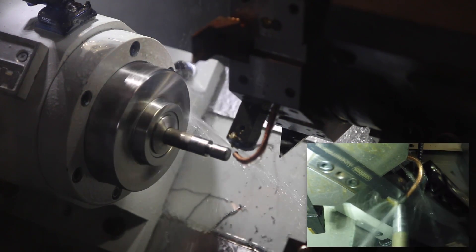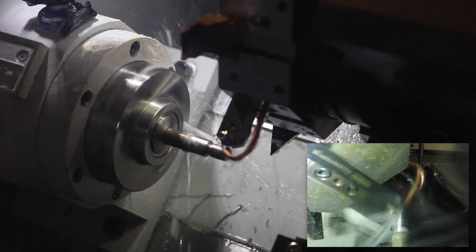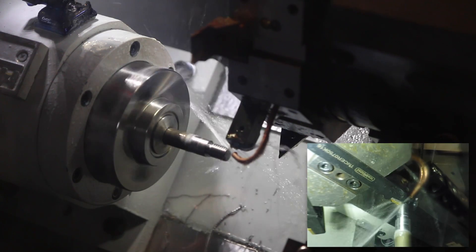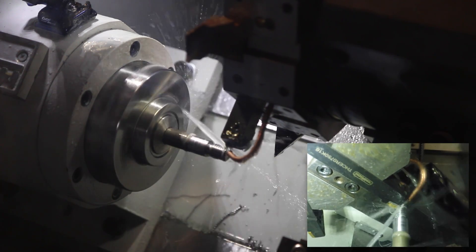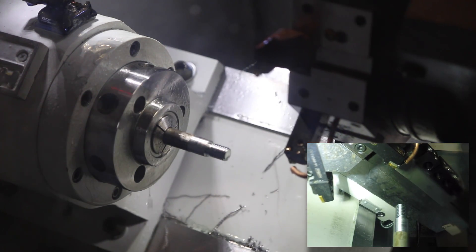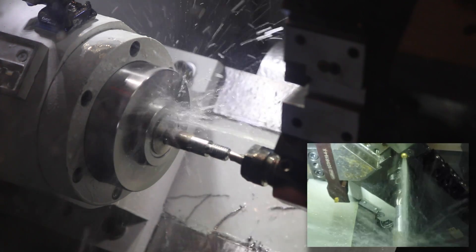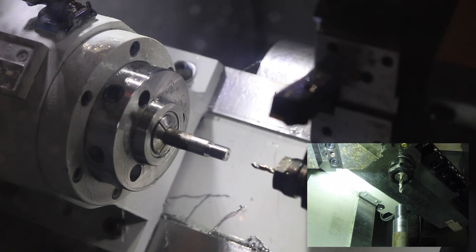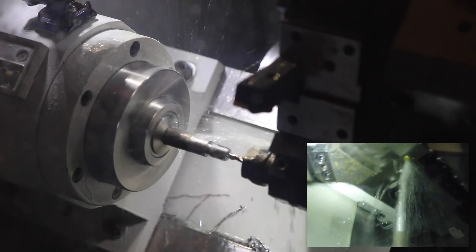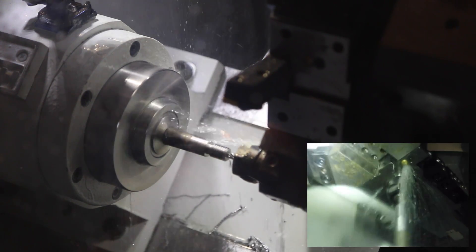Single-point CNC threading — I think it's just bonkers. I've got one of those brass coolant nozzles, I just threw it on. I've got to add them on a few other tools to make sure you get the coolant in the right spot. Beautiful chip. We'll see how this fits with thread fit with a nut when we're done. Now we're on to spotting and then drilling. Nice peck job. When you're peck drilling, you do want to flush those chips out and try to dissipate the heat. This should be pretty forgiving, but it's something I want to improve.